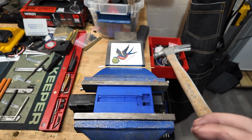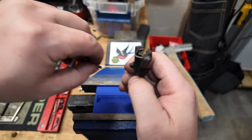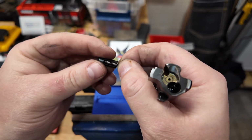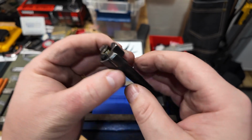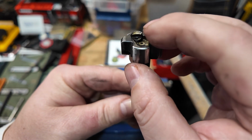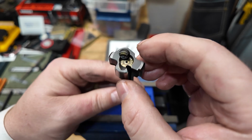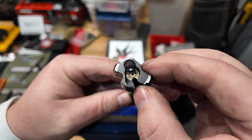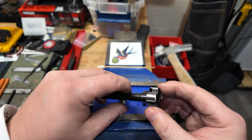Set this aside. We're going to take the bolt itself, okay? We're going to take our spring and spring guide. Those are already installed. We did those in earlier steps, nested inside the cavity. And we're going to insert it into its place inside of the bolt. If you look, the paw, now it's lifted just a little bit, we're going to resolve that in just a minute, is properly rotated as it would be grabbing the base of a 223 case. All right, so we're going to set it inside this block ever so politely.